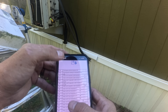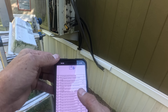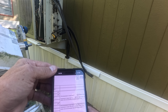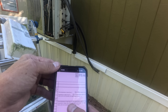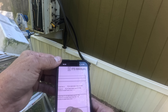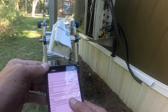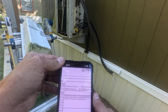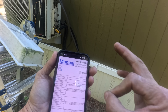According to this, 19 and 20 are both indoor unit evaporator outlet temperature errors. If the temperature is lower than negative 9, or if the temperature is higher than 70. It thinks it's below negative 9. Let's try resetting this and see if we can't read pressures and start over.